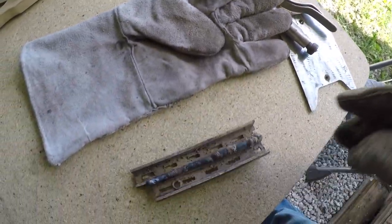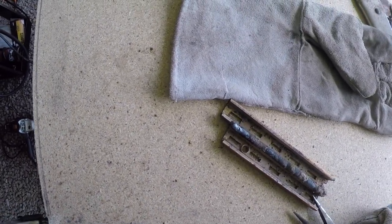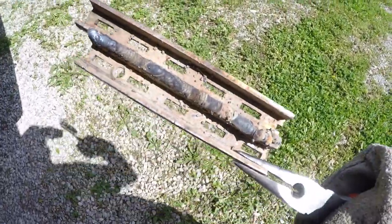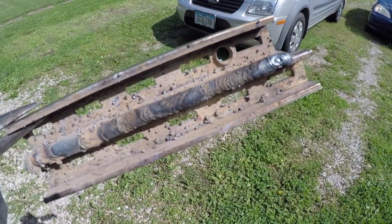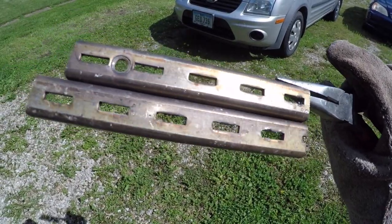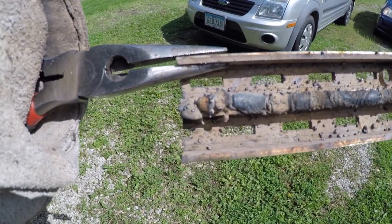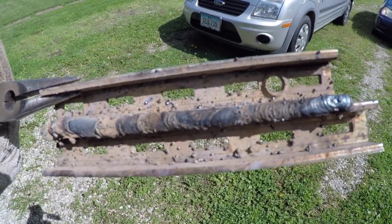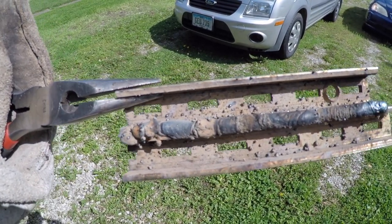With a different thickness of metal. That's still hot. Look at this. Went with a different thickness of metal, welding these two pieces together. Now these are 1/8 of an inch, just a couple of these little scrap things I had laying around. And once I finally got it adjusted, it seemed like it did a pretty good weld, but it's still not much flux coating on top of that.